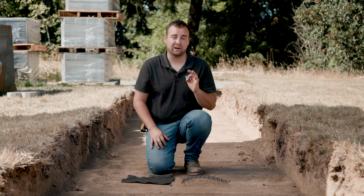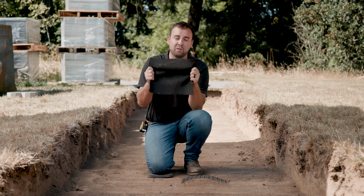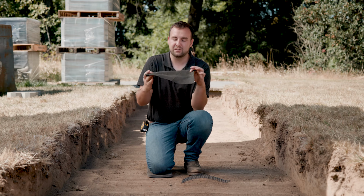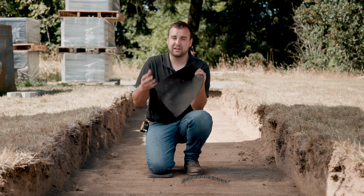Before we start bringing in that gravel, we're gonna make sure we lay down a layer of geotextile fabric. This specifically is a non-woven filter fabric, so that water can still be permeable through this fabric, but it still creates a barrier between the dirt from migrating up into our gravel and having weak spots or settling later on.